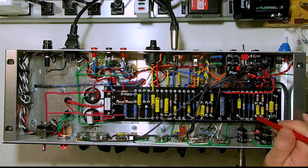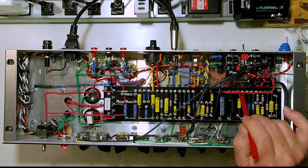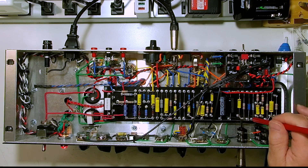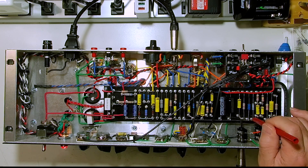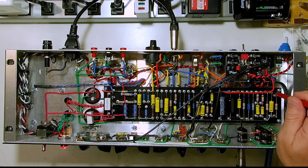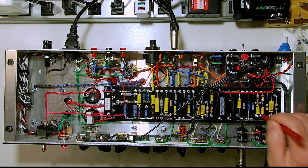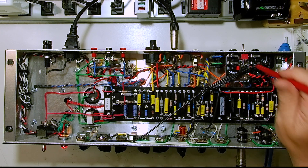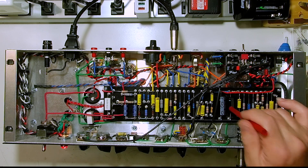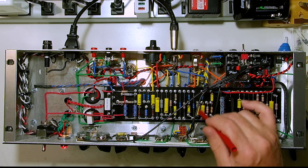The coax connection is good — no noise there. The other end is also fine. This capacitor we just put in is good, no noises. The new resistor we put in on V2B is also clean, no noises as expected. I'll tap on the turrets and boards generally — not getting any noises.